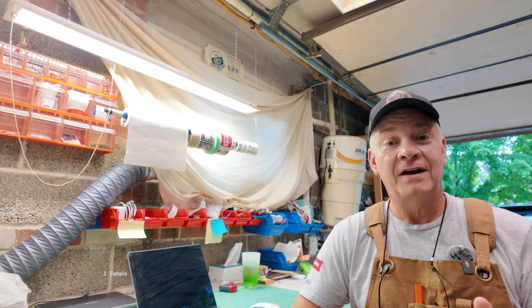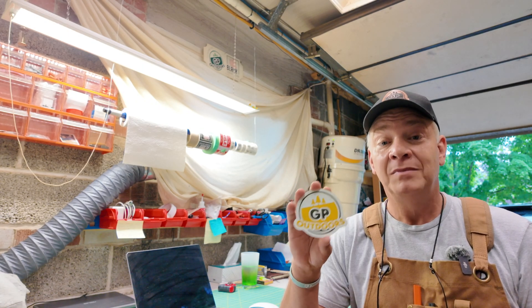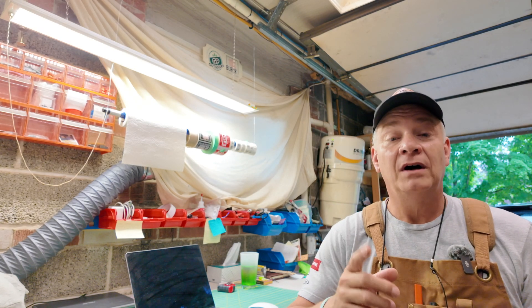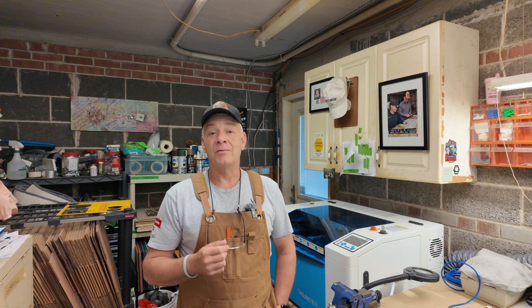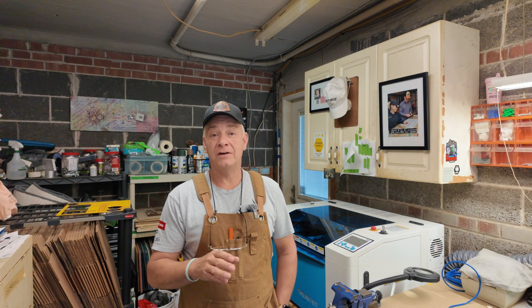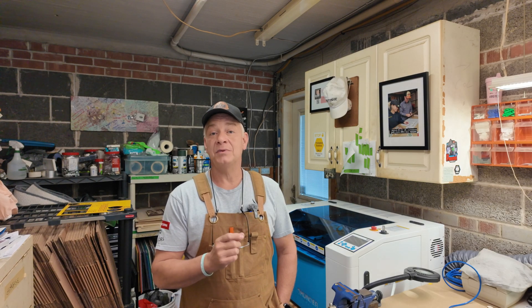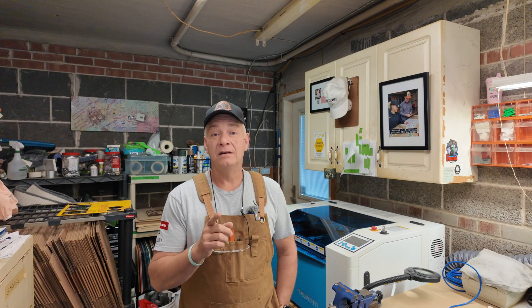On a previous video about five months ago, I provided you the settings I determined for how to cleanly engrave this tri-layer material from Romark, because you've got to be very specific — the layers are very, very thin. I mentioned in that video that on my third pass I had to use the crosshatch function to get it clean. Shortly after, I got a call from Robert at Computer Creations, a very nice and experienced laser operator. He mentioned that with gantry style lasers such as the Bolt, the crosshatch function is not intended to be used. I talked with Thunder Laser USA support as well as Thunder Canada support, and they both confirmed the same thing.